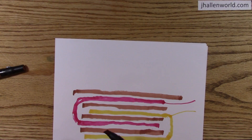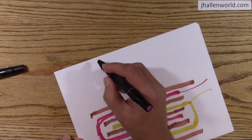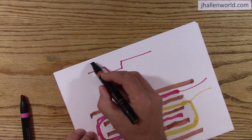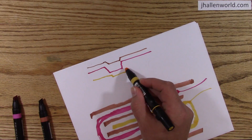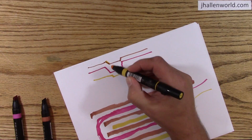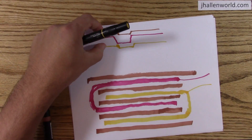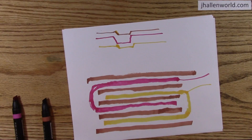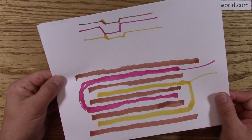Why I think this works so well is the paper towel. You want fluffy, patterned paper towels with big ridges in them. Think of the paper towel having a big ridge — one electrode up here, another electrode down here. When the edges get pressed in, I think there's a huge increase in surface area — more than just the parallel plates becoming closer together. These ridges are creating a huge effect. So definitely use premium paper towels with a pattern. I've tried foam and fabric and other things — paper towels work the best.